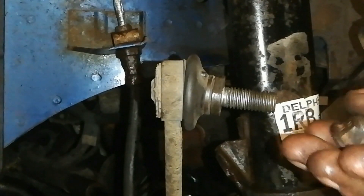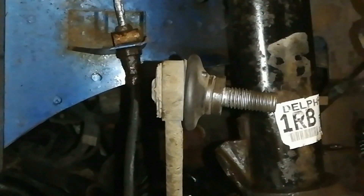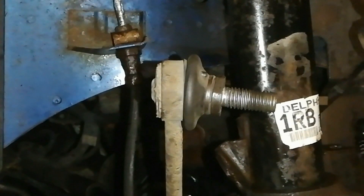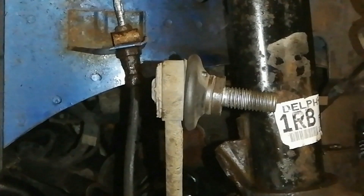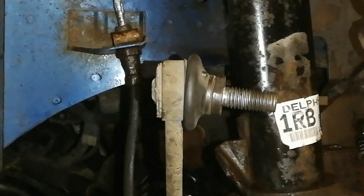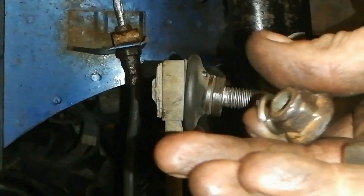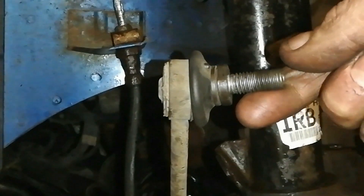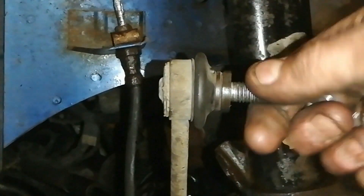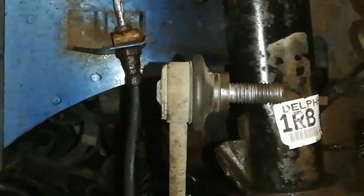These two nuts are correct for this because that has a 1.5mm thread pitch. We can get that on there and that's just to check that those are okay. I may just put them back on again just to keep them happy. You can counter-hold this and it makes it an awful lot easier.